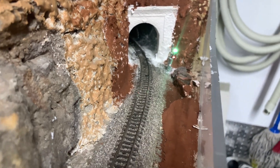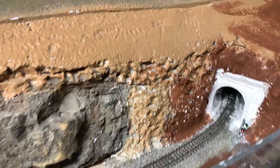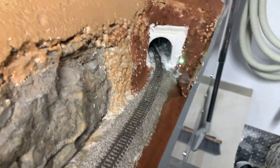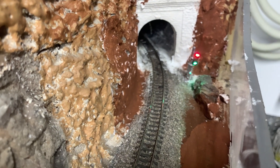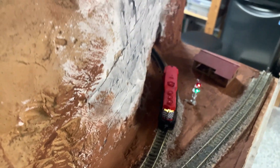That's a yellow aspect — yellow is a combination of green and red. This is very important: you have to know what the block ahead is doing. You have to have block occupancy connected to these lights, not just have them triggered by a turnout. Also, the locomotive is taking the main route — this one on the right is diverging. If I switch that turnout to the other side, the bottom signal goes green because it's taking the diverging route, and the diverging route is not occupied.